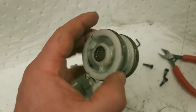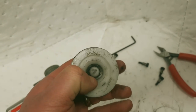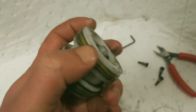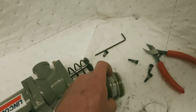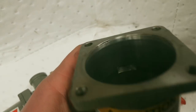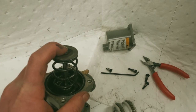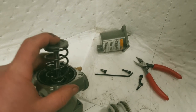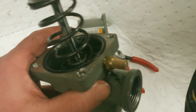Here's the piston - that's the front end that bears on the spring. Here's the back end - that's a little bung and bumper. These are actually urethane seals and you can see the two ridges on there. It moves back and forth, and when it goes far enough you can see the air scoots past. Here's an interesting construction detail - it's a weldment. This chrome-polished OD shaft is actually welded to this bearing plate for the spring, and then that's a fairly heavy spring that goes through and must actuate the pumping element on the output side.